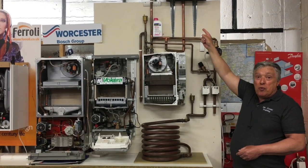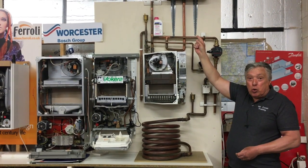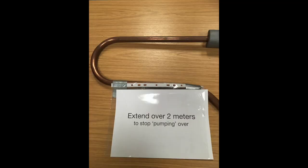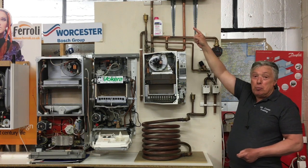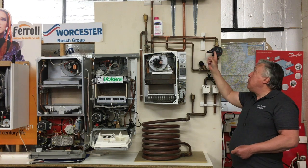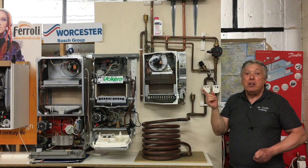On the 22mm vent above the tank, cut in a 22mm compression fitting. Add the extra height — around 2 meters — so that this pump cannot pump over. Sludge cannot begin. And don't forget to put plenty of inhibitor in.